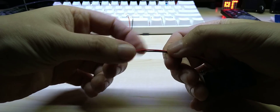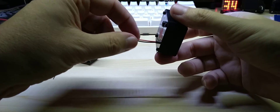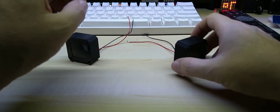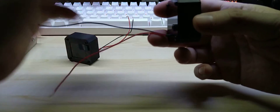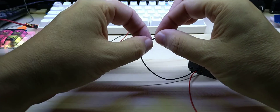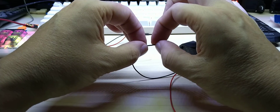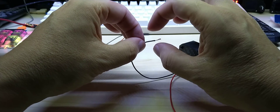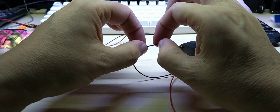As of a few months ago, I am using silicone wires — these are high quality silicone wires with very fine strands. I also use these with my gear indicator, which is actually based off the same PCB. They are not cheap, but I don't use a whole length of it. The main reason is: if you have regular wire with a plastic insulation and you tin the wires — which I do when I solder to the board — it just melts away, and I hate that. Silicone wires are heat-insensitive, so even if you tin the wires, it does not melt the insulation.